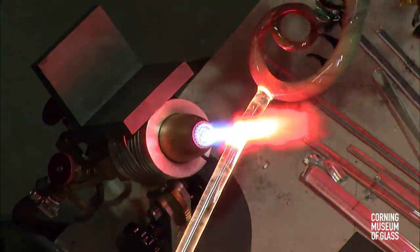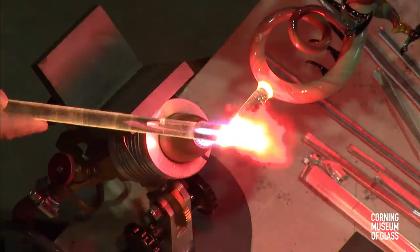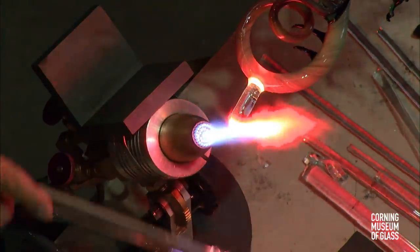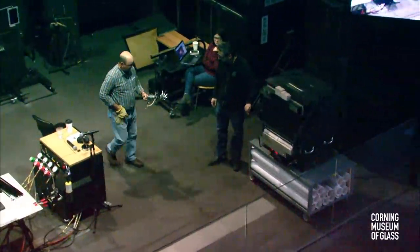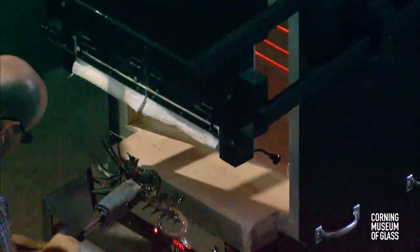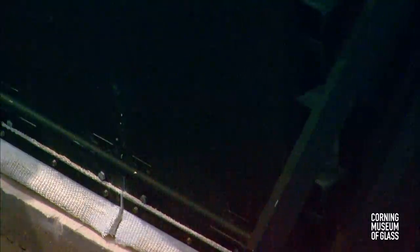Annealing with borosilicate, a rough rule for basics. Different types of shapes can add a bit more strain that you may want to anneal for a little longer, but we typically will base annealing schedules on thickness, the thickest part of the object. With borosilicate, about 5 minutes per millimeter of thickness to soak, to hold at that 1050 temperature. And then with an oven like this, we can just shut it off. It's going to come down over the course of about 6 to 8 hours, ease the piece back to room temperature, and it'll be perfectly stable.